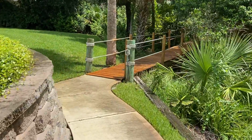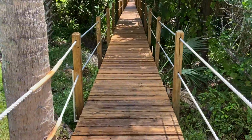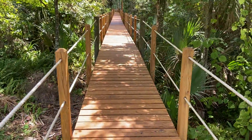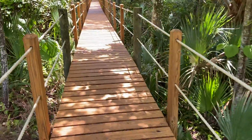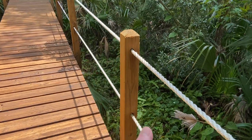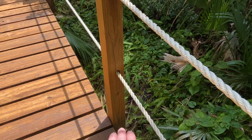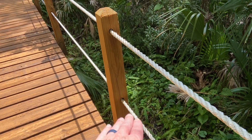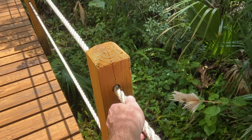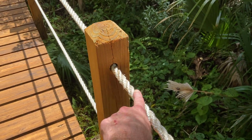There's the beginning of the walkway there. You can see those nautical ropes. Now, what I suggest doing is getting some foam insulation and cutting the foam insulation to fit around the nautical rope. And what I mean by that is taking the foam insulation and placing it right over here on each side, so that when you roll this out, your stain, you can be kind of sloppy and bump into the foam insulation. And then when you're finished, take a 2-inch paintbrush and go around. And that way you've cut in and you haven't gotten anything on the nautical rope.